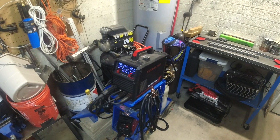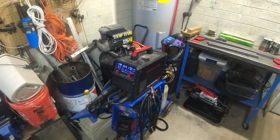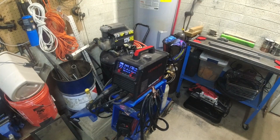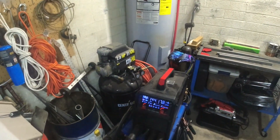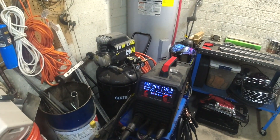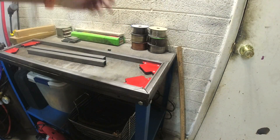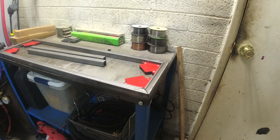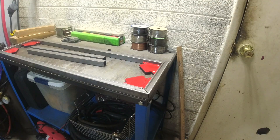For full disclosure, I'm using the YesWelder MIG 205 DS Pro plugged into 110 volts, with 0.035 solid core MIG wire, running straight CO2 gas at 144 inches per minute and 17.8 volts. I'm going to get each corner squared up, leveled, and tacked, then do the same to the next corner all the way around. Then I'll measure diagonally, square the whole thing up, tack on the inside, and see how it turns out.